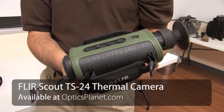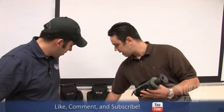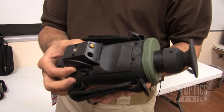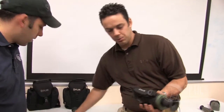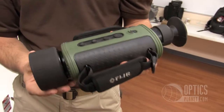This is a 19 millimeter, 1x magnification. The TS-24 is 240 by 180 and the TS-32 is 320 by 240, so it's about 45% higher resolution. These cameras have a detachable hot shoe, swappable batteries — you can put the hot shoe right on here, you've got power and video out, so you can run that on a tripod and record video externally. You can also get a 2x extender, a 2x optical doubler with a quarter-turn quick disconnect, to extend your range in the field.